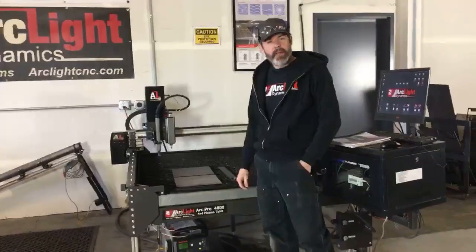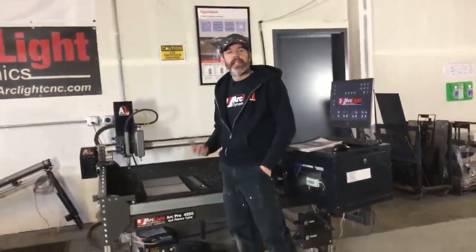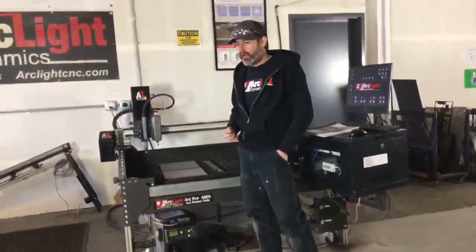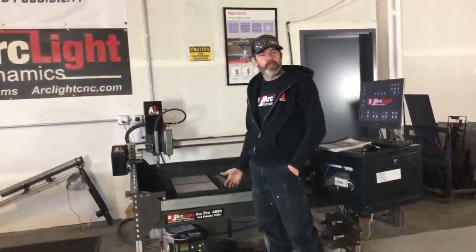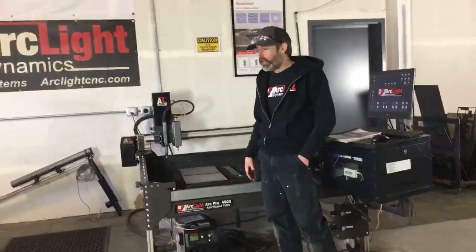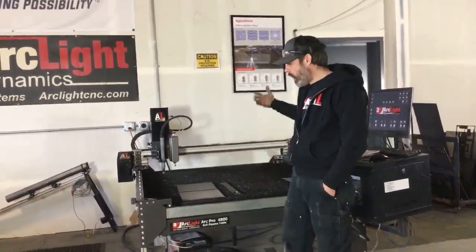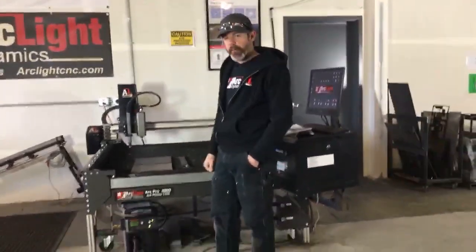and then the water will evaporate, and you'll add a little bit more anti-corrosive agent to keep the rust at bay. With a school situation, you're probably going to be filling up your water pan with anti-corrosive agent at the beginning of the semester, and at the end of the semester, when you're done with all your cutting, you'll be draining your water out, pulling your slats out, and then scooping all your slag out and throwing it in your recycle bin.